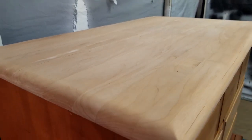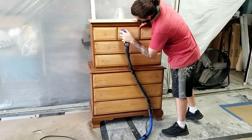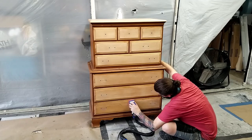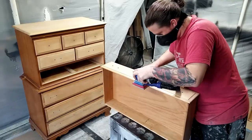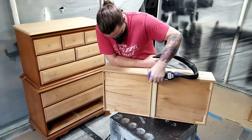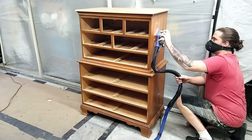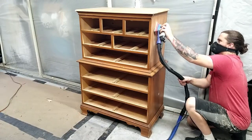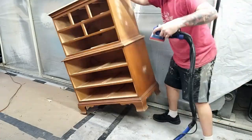This is what the raw wood looks like once it's stripped and fully sanded, ready for stain. After repeating the same sanding process on the drawers, I moved on to sanding the body in preparation for paint. I'm mostly just lightly sanding the surface while feathering out any imperfections with a little more pressure — the idea is to scuff up the surface so that whatever you apply over it has something better to adhere to.